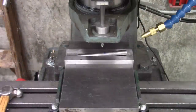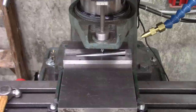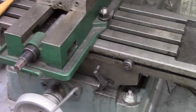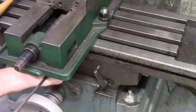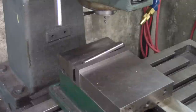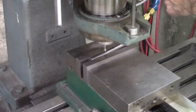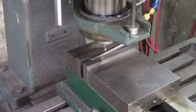Put a ten-thousandth feeler gauge under one end, making it so it's just sitting on that feeler gauge and flush with your vise. It's not extremely critical — if it were I wouldn't be doing it like this. I've got my end mill centered on the three-eighths so we're all set up in this direction. On the mark we made, you want to set a stop so the edge of the mill is right on that mark.